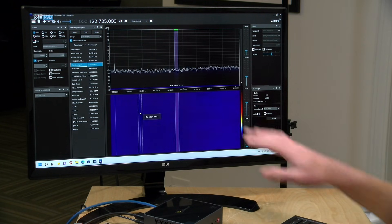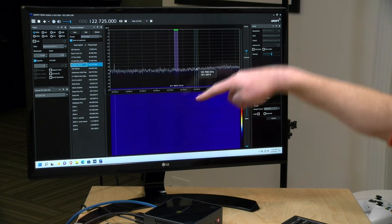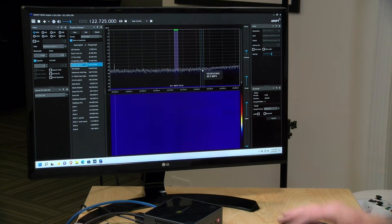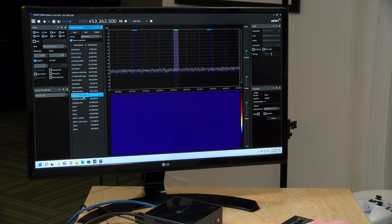Right now I've got it tuned into my local airport. Because the airport is on the air band voice area, I can quickly browse around and see what else is being transmitted from airplanes flying overhead. I also have my local NOAA weather station programmed in, my local fire department, and a few other fire departments — so you can use this like an old radio scanner. You can even get plugins for SDR# that will monitor a set of frequencies and tune in automatically when traffic is detected.